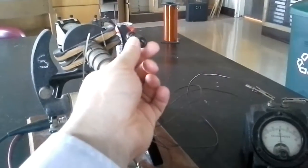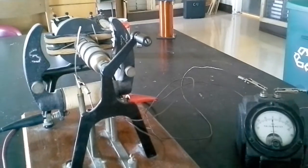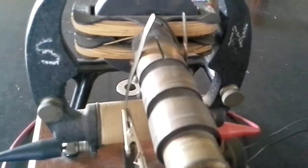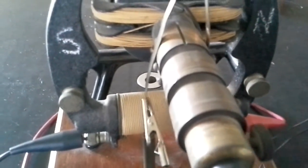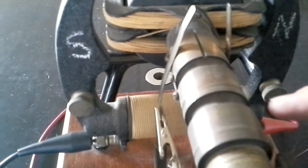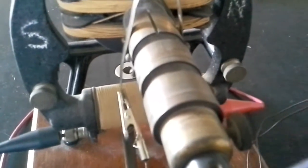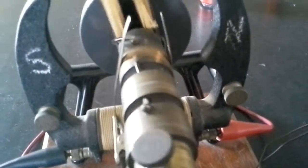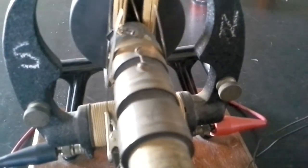So that's really different behavior than before, and I want to explain how. It has to do with the configuration of the brushes. So notice they're no longer hooked up here and here like they were before. And when they were there, the brushes might as well have been wired directly to the galvanometer because they were touching here, and that was what was wired to the galvanometer. And as I spin it around, we don't see any breaks in the metal. That's just one solid piece on those front two rings.